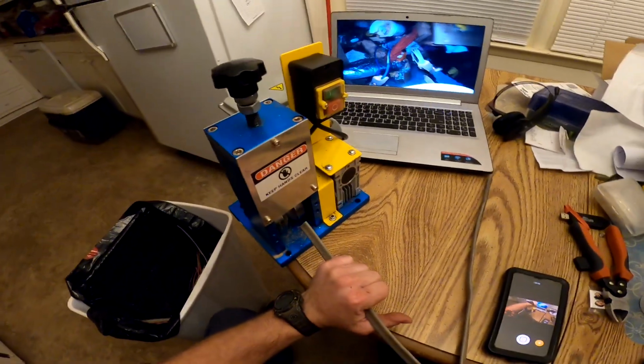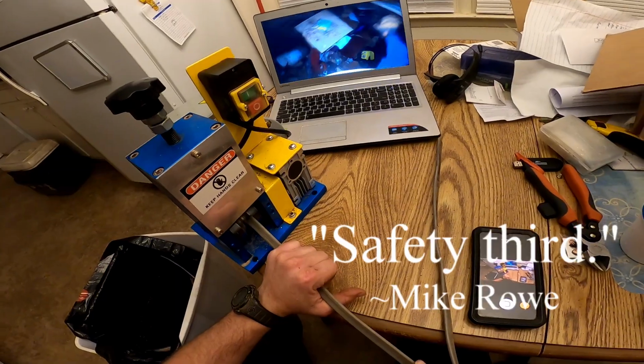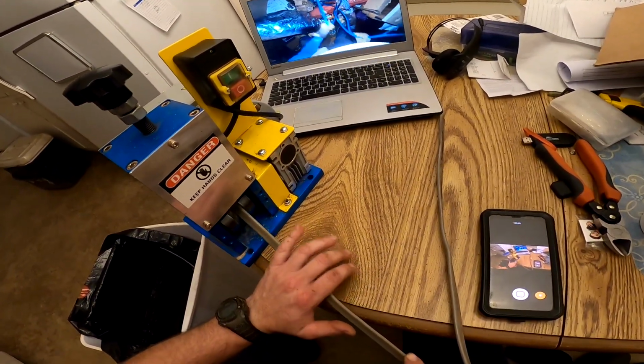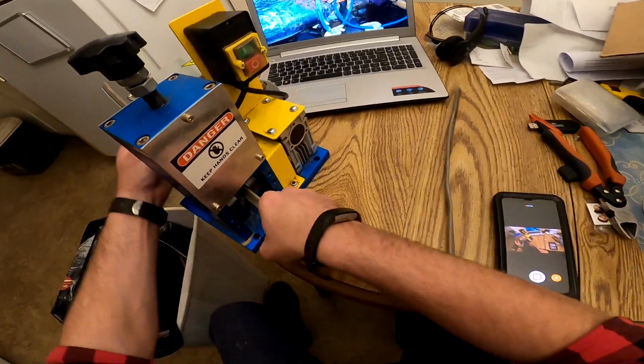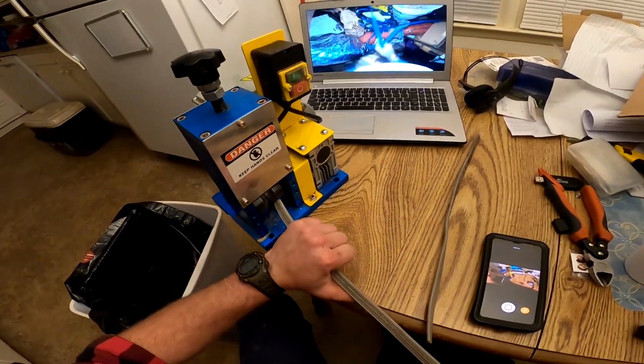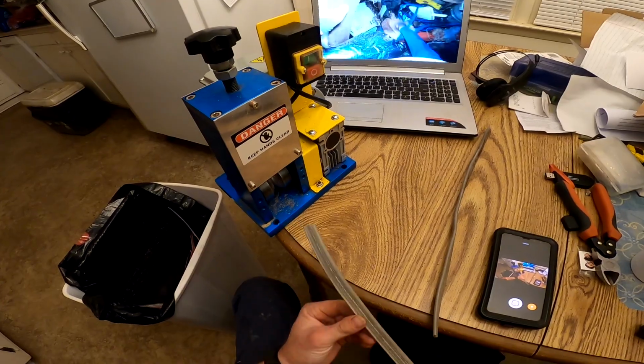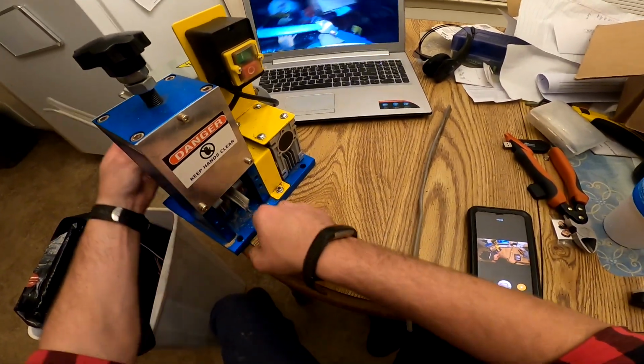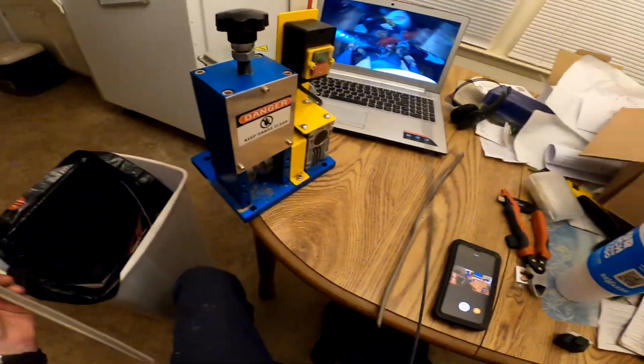We're going to put it on a slight angle where it meets the angle in here that these rollers are on. Catch that, push it in, let the blade catch into the outer coating. We're going to pull it out, turn it around where the cut side is down in our hand. We're going to run it back through. And now we've got our piece of wire out.